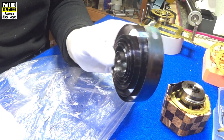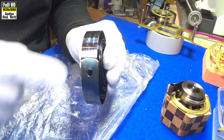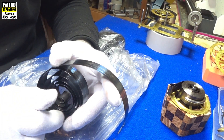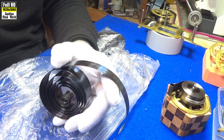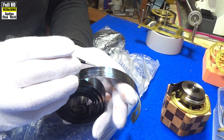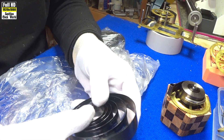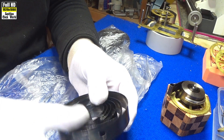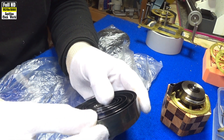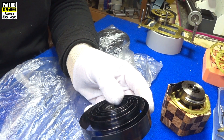This is a clock mainspring. It's a hole-end mainspring, different from a loop end. Now there are a couple of measurements that are important when you're changing the spring in a clock. The first one is the diameter, or the width of the spring. The total length of the spring is relative to the length of time the clock runs for — whether it's 24 hours, an 8-day movement, or a 30-day movement.